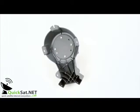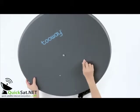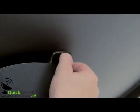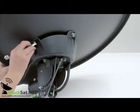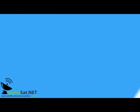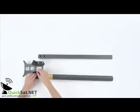The next stage is to secure the antenna to the elevation azimuth head with five coach bolts and five flange nuts. Tighten all five nuts and be very careful not to deform the dish in any way. Now construct the two arms by first securing the TRIA support plate with four long coach bolts, washers, and split washers with normal nuts.